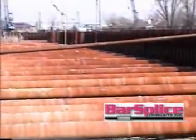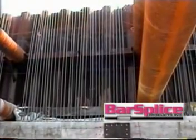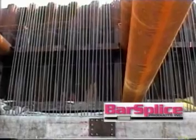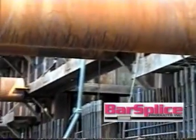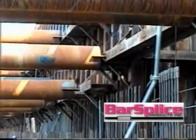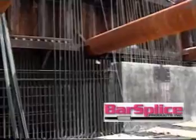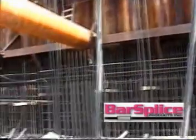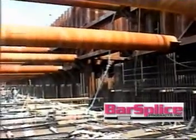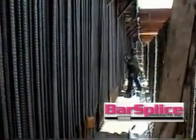If you look a little deeper, you'll see that it is built in 14 phases, and that phase 1 and 9 to 14 is a cofferdam. Inside the cofferdam, there are 3 rows of whalers and struts. The bottom row of struts is 7 feet up from the bottom. The middle and top row was 10 feet on center above the bottom row. The struts went from side to side at 20 feet for the 800 feet length of the whalers.